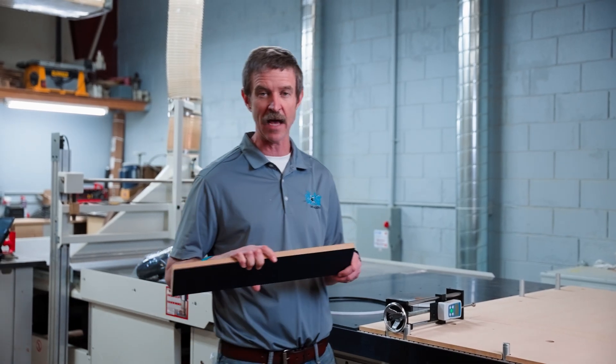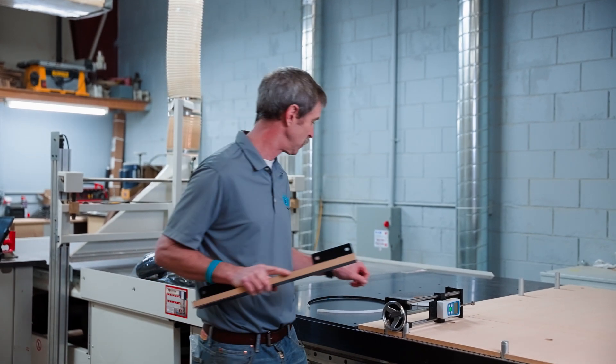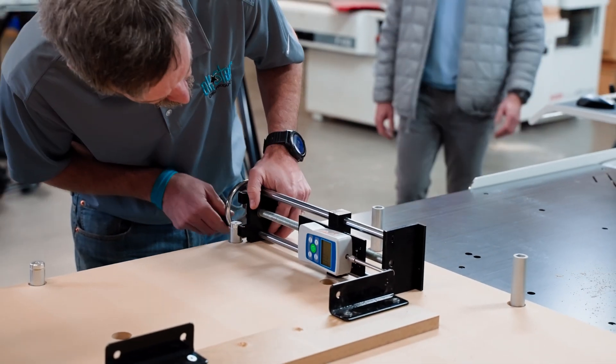So what do they do? Usually onion skins or tab cuts. A great solution to prevent that is our onboard gasket material. Real quick, real easy way to get a vacuum clamp on your part — not just downdraft. A way that we can prove this is we've got our push-pull gauge meter here, which shows how much pressure it takes to move a part out of place.